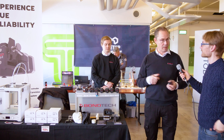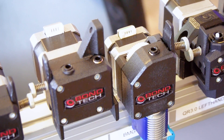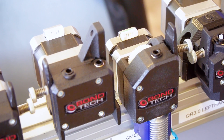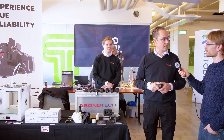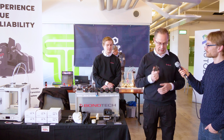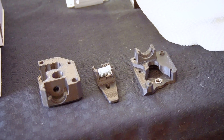What we have done is we've sent out the products, asked for people's feedback, and taken that feedback to develop new versions. Our latest extruder, the BMG, is an answer to people wanting a lightweight extruder for direct drive applications who want a secure grip and don't want grinding or failure. You've got the tiny 3-to-1 gearing in here, the quick release lever, and you still have the dual gears?